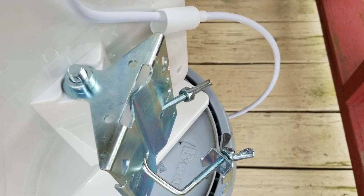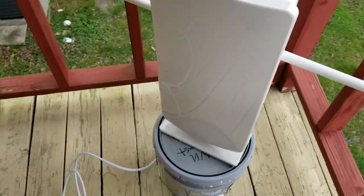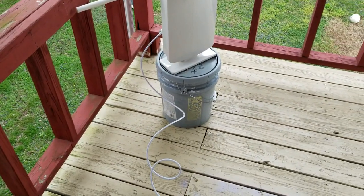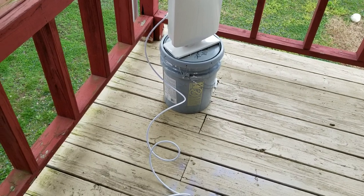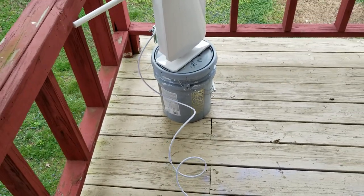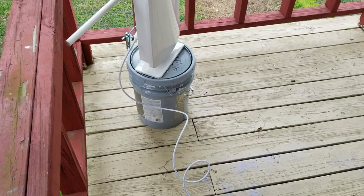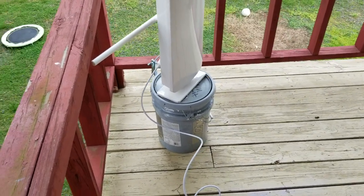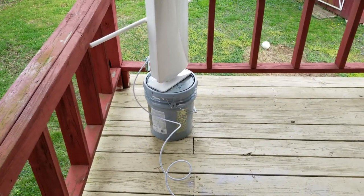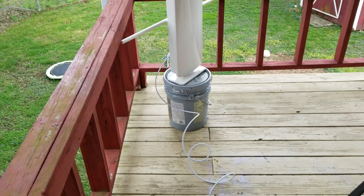Here's a tip: a lot of companies supply cables that are not the highest quality. I noticed on this RG6 cable the center conductor is copper-clad, and that's not going to give you the best signal possible. If you want a little better signal, you could upgrade to a premium solid copper RG6 cable — it might help if you're trying to pick up a particular channel that's not coming in perfectly.